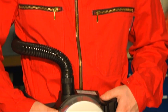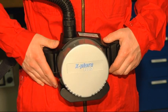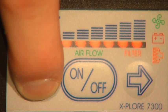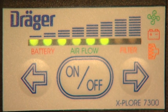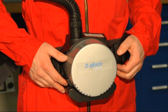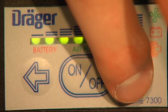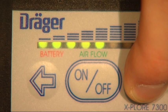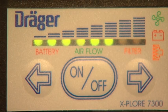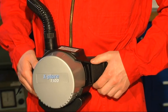The operating duration of the rechargeable battery is between 6 and 15 hours, depending upon the selected airflow. Occasionally check the battery status by holding the left arrow key for about 1 second — the fewer LEDs which illuminate, the lower the charging state. You can also check the respiratory filter saturation during operation by holding the right arrow key for about 1 second — the more LEDs which illuminate, the higher the saturation of the respiratory filter. The airflow of the unit remains constant regardless of the filter saturation or the battery charging status.